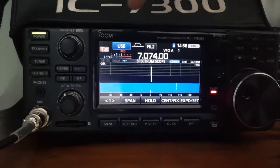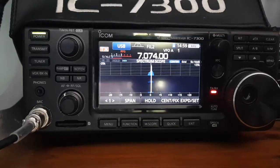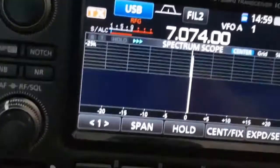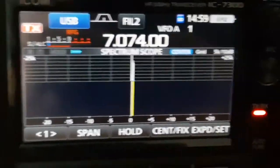See the way it's tuned. You need the ALC output so that you only get about one bar. If I move the FT8 power up a bit, see the way you've got about seven bars — you don't want that. I'll bring it down. See that — just one little blue bar showing there. You don't want the ALC too high. Right, let's go to the computer.